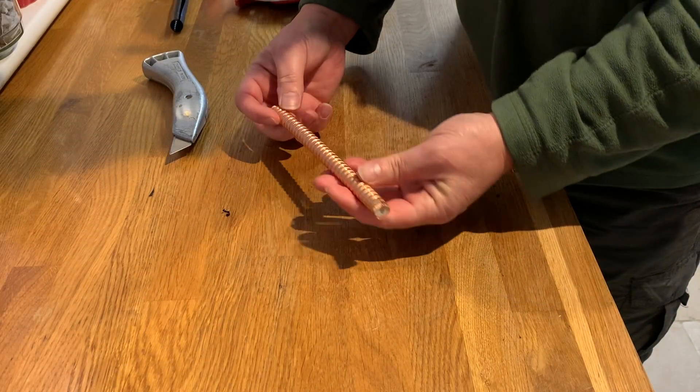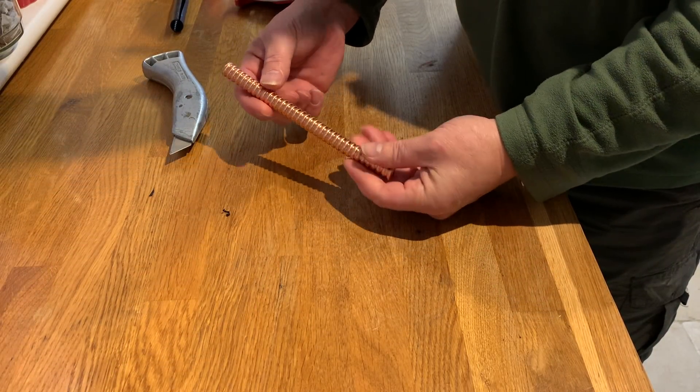We're going to try to measure a couple of lengths of hard line. This is a Heliax, Andrews Heliax, which is the 15 mil variety, 75 ohms. It's not really important what the impedance is on this particular length of coax because I'm going to be cutting it into two five-meter lengths to make my loops. We're only going to be using the external shield braid core — it's actually solid copper on Andrews — which is why I'm choosing it.